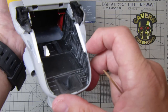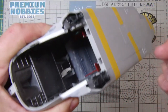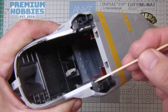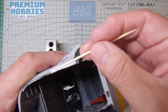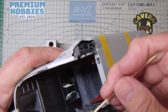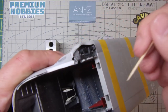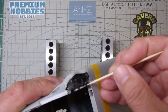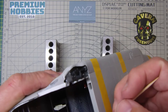On the underside, or the entrance into the rear, the alignment of the sides wasn't very good. So these had to be filled with plastic strip and sanded back. I'll go in and tidy these edges up, then mask the whole area and paint those areas that aren't painted at the moment.